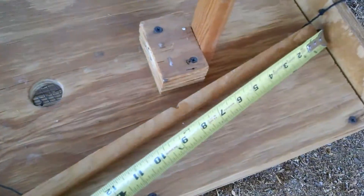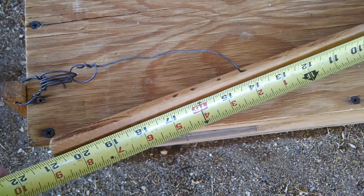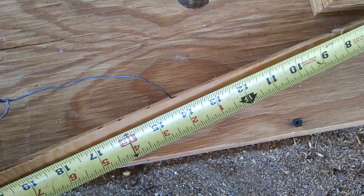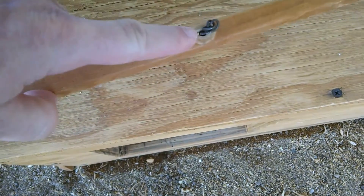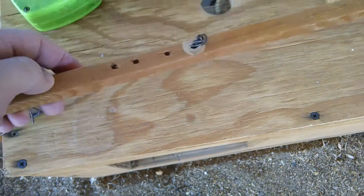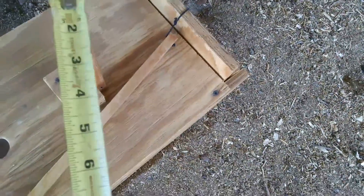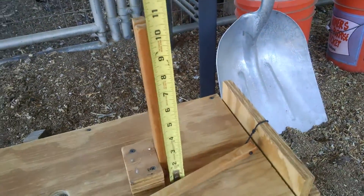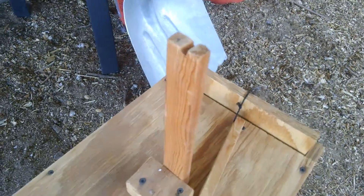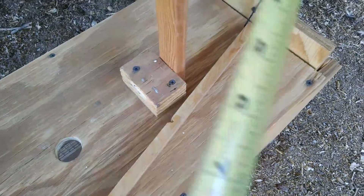Let me get my measure tape out. Starting with the teetering part — I made it about 21 inches, but it definitely didn't need to be more than 16 inches for me. I put a couple holes in it; 14 and a quarter was the hole I ended up using. I just felt it out as to where it should be while teetering it on the post. My post is about 10 and a half inches tall. I put a notch in it, but it didn't really serve too much of a purpose. I felt the notch on the teeter was more important to help identify its spot.